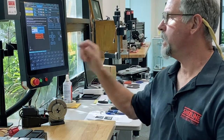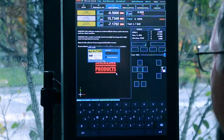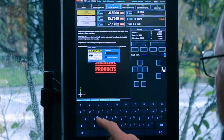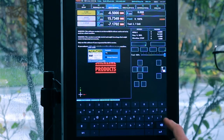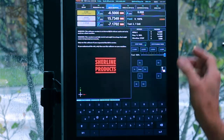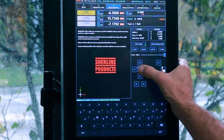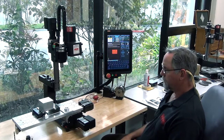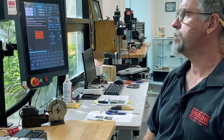This is how your machine should be when you get it. I'm going to push in the e-stop, click it off, enter the password — lowercase 'sp' — and hit enter. Now I'm going to home up the machine again. And all axes just homed out.